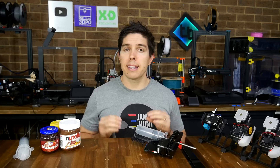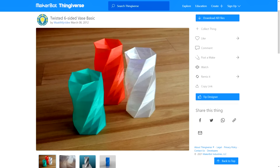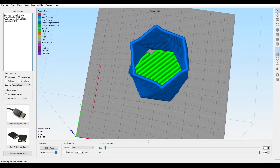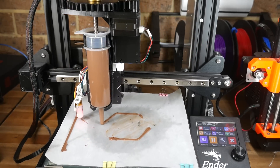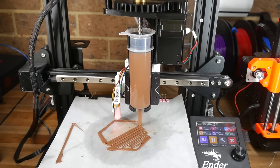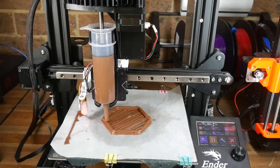So far I'd only been printing single layers — really that's only 2D printing — so I wanted to print up. Many times a paste extruder is used for printing clay. I didn't have any of that, but I did have more Nutella. The model of choice was this twisted six-sided vase, set up in the slicer to print in vase mode, which should remove the need for retraction. This one actually went remarkably well — some air bubbles ruined some of the extrusions and I probably need to up my flow rate for the solid infill on the bottom, but it's hard to argue that this isn't going down just like a regular 3D print. When it got to the walls, it worked really well also.